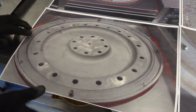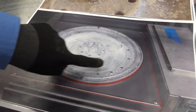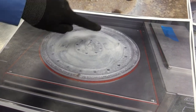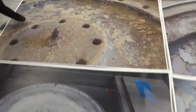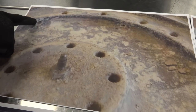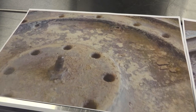In this picture, there is a very light calcium coating within the racetrack. None of the vertical steam ports or the horizontal water ports are obstructed. In this next picture, you can see one water port partially obstructed and the second one completely obstructed. This will affect performance greatly.